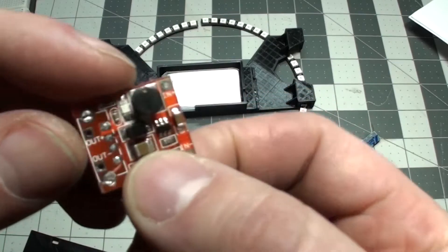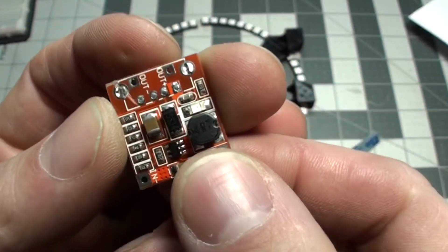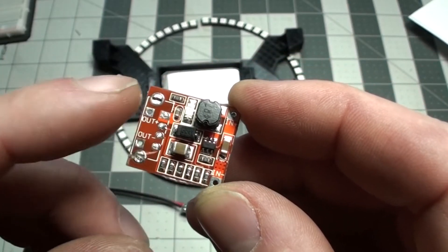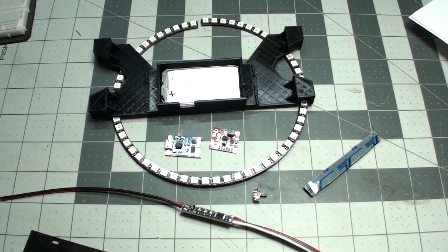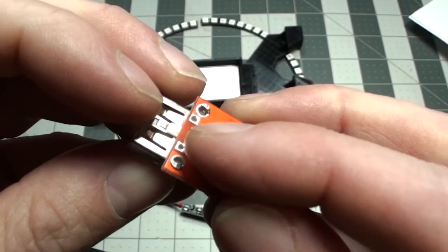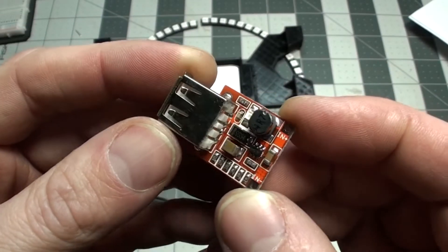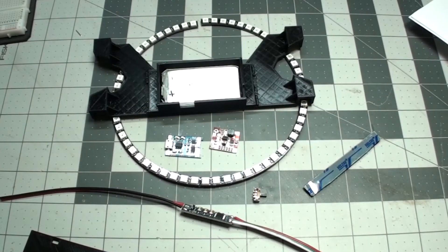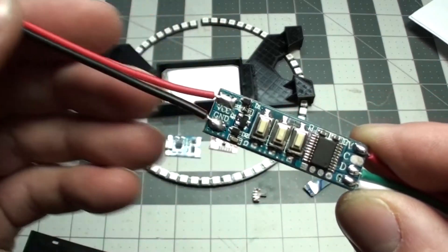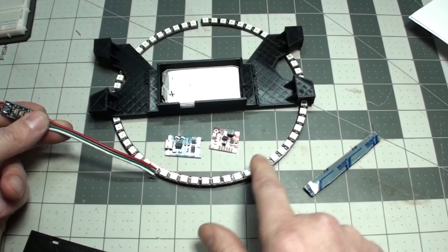Now, off of that end we are going to run into this little board, which is a 3 volt to 5 volt boost converter basically. So this takes a single cell lithium battery and it allows you to charge a cell phone or device on it. It did have a USB module — actually I have one right here. This is the way it came, and basically I just snipped it off and desoldered it since it is a bit bulky and I am not using the USB port. But this does put out 1 amp of current, and I did verify that so it actually does, which is pretty nice. And then basically off of that boost converter, I am going to hook this up to it, and then this basically ties onto the ring of RGB LEDs.